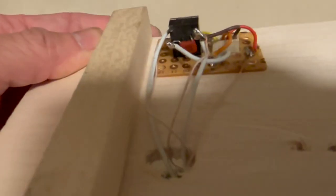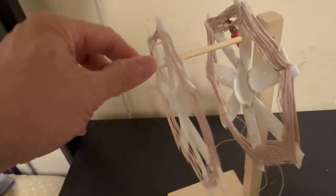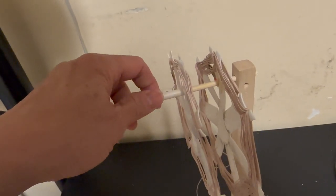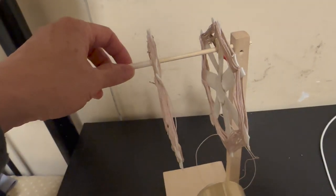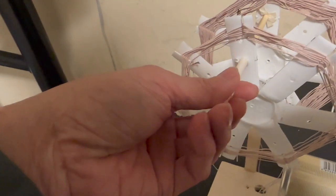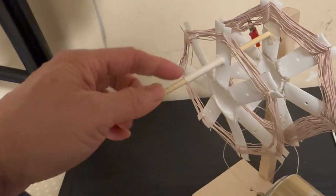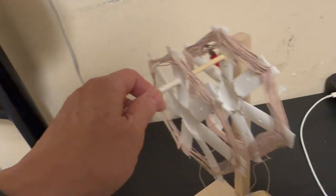We have the radio audio jack with the 4700 pF capacitor as the filter. So to secure the coil in place so we can move them closer together for higher sensitivity or further apart for better selectivity, I use the drinking straw, which will fit tightly onto a round chopstick. So you can secure that in place while you tune the radio.